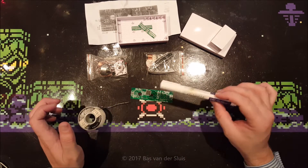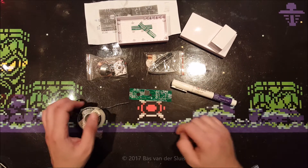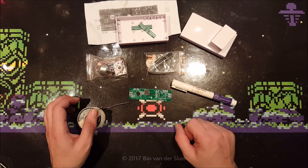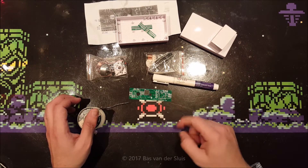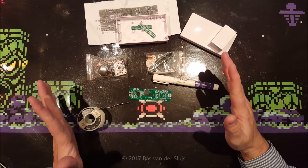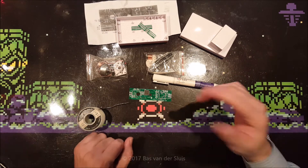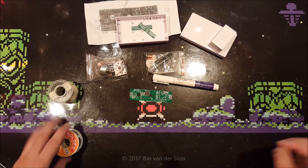So what I'm going to do: I'm going to use this Chinese flux pen. I'm going to first heat one pad, put a piece of solder on there and make sure that the processor is mounted with two pins. Then I will put on loads of flux, put a bit of solder on my iron and hit all the pins, and see if it works as good as all the other guys on YouTube do it. We'll see — I'm probably going to fail. I'm used to that. So let's start.